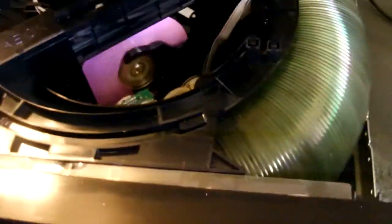It turned out I had to adjust the laser, not the RF power. This one up here is the RF power. This is an after-the-fact kind of adjustment on this resistor here. That's very high. It has to be, because I figured out I had to take the whole laser unit out from the back and set it on there. It's not easy to take it all apart and do it. I have it pretty close. It's not perfect, so the RF makes up for it.